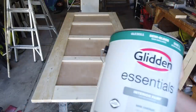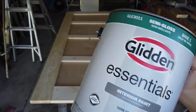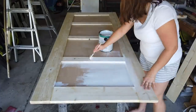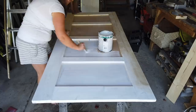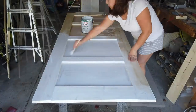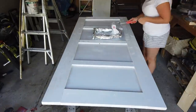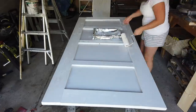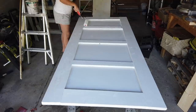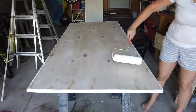After sanding it was time to paint. I'm using Glidden Essentials semi-gloss white interior paint, and I went in with my brush for the first coat just to get around the cracks, crevices, and all the edges of the door. Then I came back with a roller to make sure the last coat was smooth. I put 3 coats of paint on the front and back of this door, and then touched it up again with my brush.